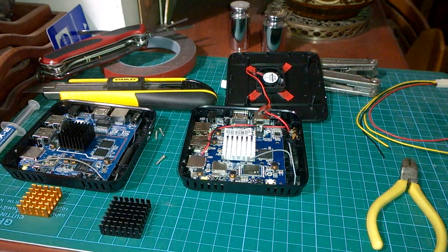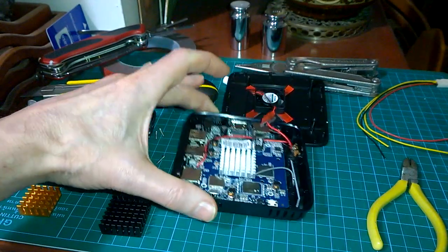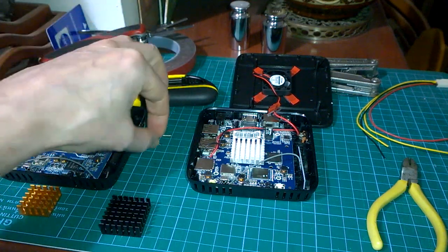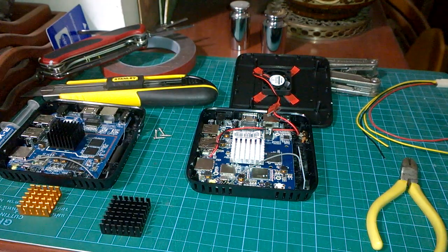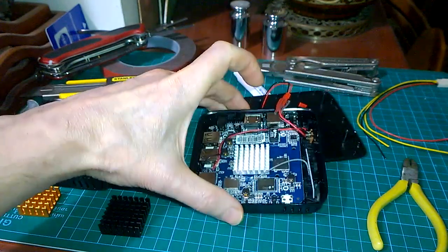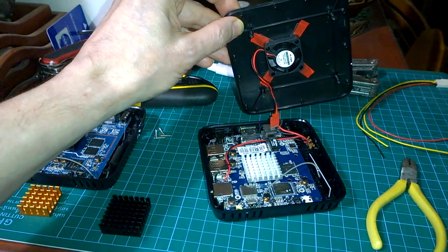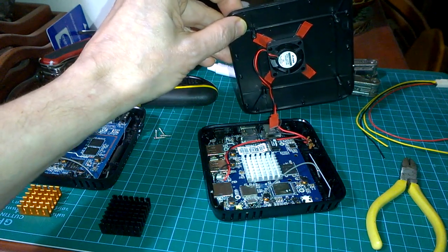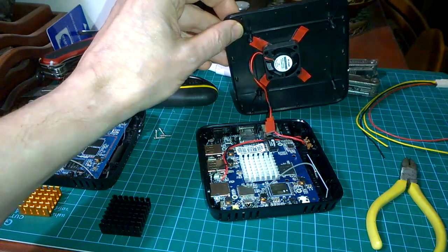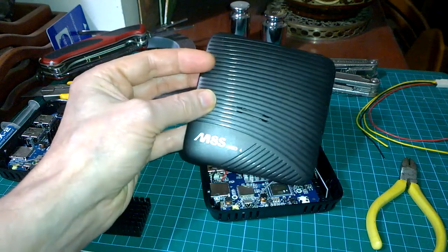The foam forces the air down onto the heatsink. Over on the left you can see four little pads - those are the UART connections, with ground and plus 3.3 volts at either end of those four pads. You just solder to those. I've soldered the positive through the little switch, and the negative comes around and up to the fan. The fan has a little red plug and I've poked the wires into the socket - if you tin the wires slightly generously they just plug in really neatly. A little bit of double-sided tape holds it in.